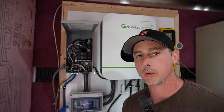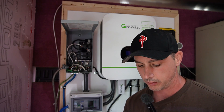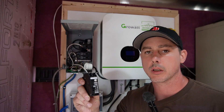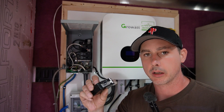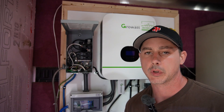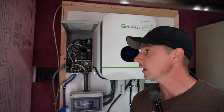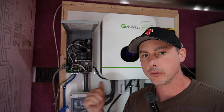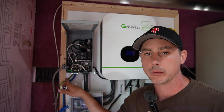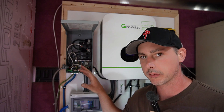In this video I'm going to be wiring up some outdoor plugs and lights. To do this I'm going to use a GFCI breaker. This is going to protect me outside from any kind of ground fault situations, and I'm going to be wiring it up to my main panel output panel in this video. This panel is neutral-ground bonded and I do have my own grounding plate out in the garage. This is completely off-grid, by the way.